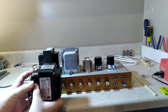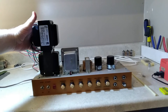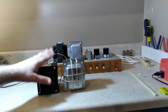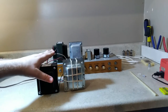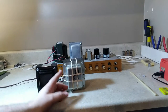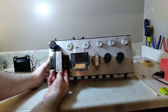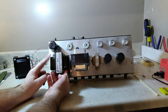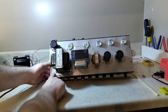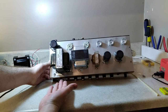Just a bit of a size comparison — you can see this Hammond is quite a bit larger than the transformer it's replacing. Here we have the Bassman-size transformer next to the Mojotone JTM45-size transformer, which is an official Marshall transformer — you can see it's longer and wider, so it will not fit in this chassis. To mount this stand-up transformer in the lay-down chassis, I got a double-gang switch plate from the hardware store and attached it to the chassis, punching holes through for the wires.